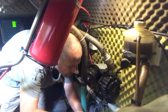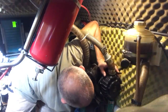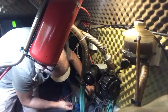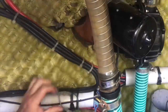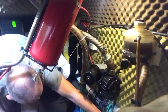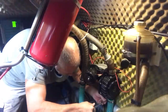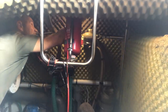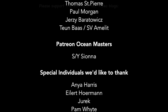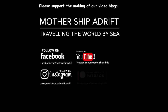I'm just filling the pipe with water — I know it's a self-priming pump but this just helps it on its way and makes sure that the valves don't burn out before it gets water to them. This is the float switch here so I'm just going to try it. So thanks for watching — thanks in particular to our patrons who keep us going. If you found it useful, give the video a thumbs up. If you want to buy me a coffee or beer you can do that by following the Mothership links to the PayPal page or the Patreon page in the description below.